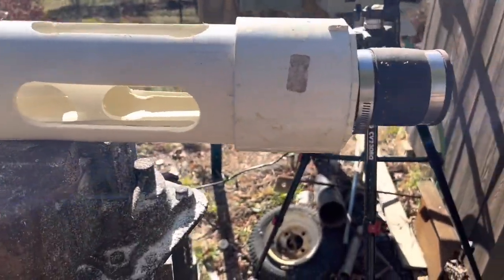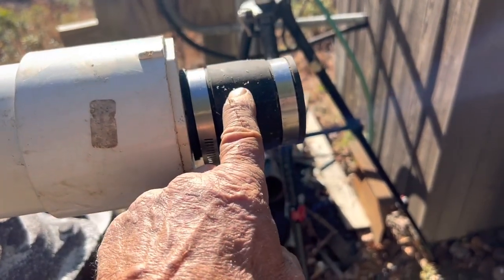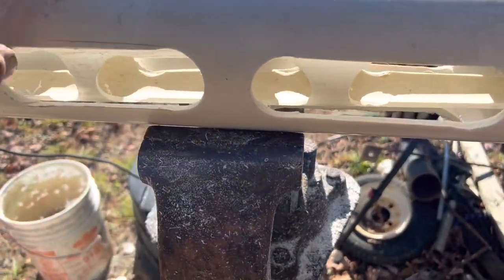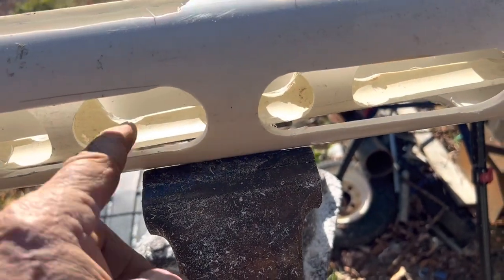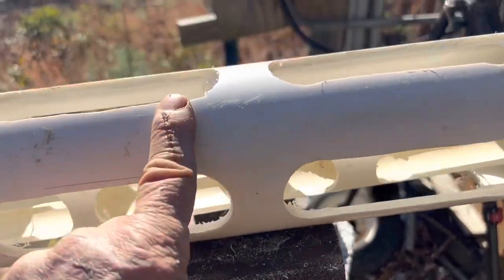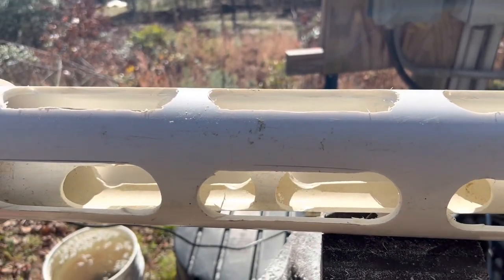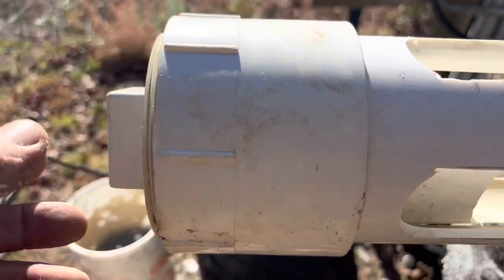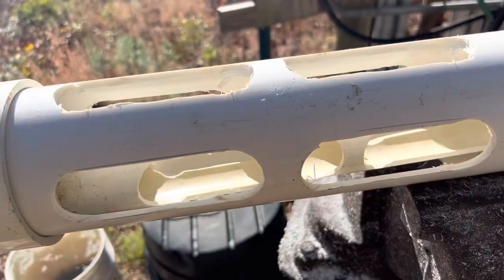Basically, this is what it's going to look like. When we get ready, we're going to glue this — I'll take you along then. This is the coupling that will hook it inside the spring, and then we'll have the two-inch piece of pipe up here wrapped in a fine screen. This one will have a coarser screen on the outside. All this is just pushed on — we'll put a little Teflon on it. It's just pushed on so we can break it all apart to clean it.